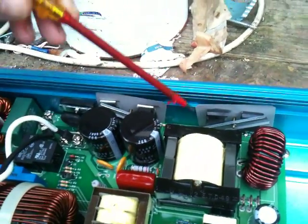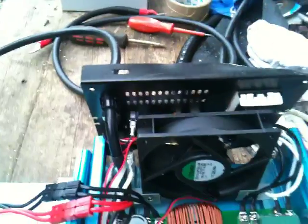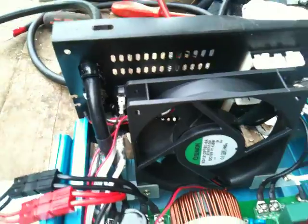These fixing bars here are actually touching the solder on the bottom of that diode there, and the same on this one. The screws are actually touching — there is an insulating layer on top but that could easily break down — it's actually touching high voltage parts of the board. The screws obviously go to the case and that would render it at quite a high voltage. This cooling fan is drawing air through only a few small slots in the front panel.